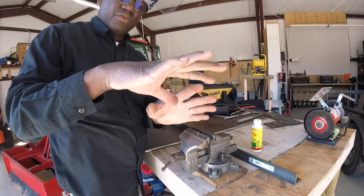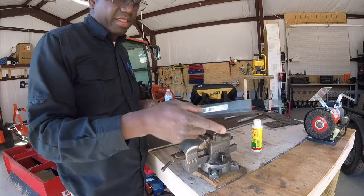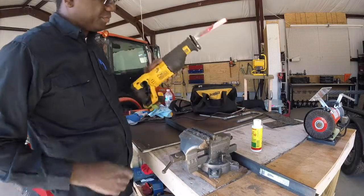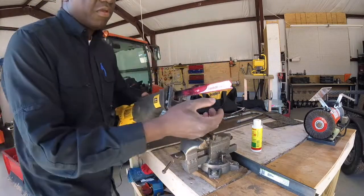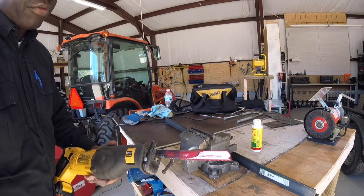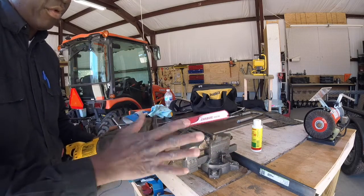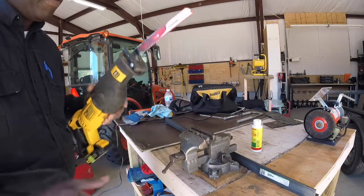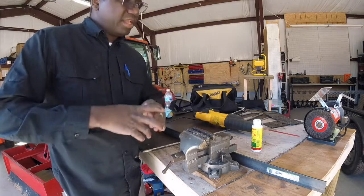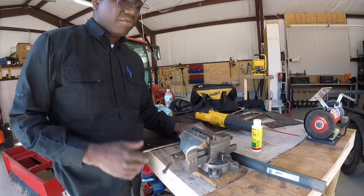What I'm going to do now is fit the plate with the studs to the wheel first, then get some measurements. Then I'm going to cut this off and weld it to the back of that 1/4-inch plate — this is 3/16 angle that I'm going to use. I bought the Diablo carbide blade for a sawzall to try it and see if it makes a nice clean cut. It should do 3/16 with no problem. If not, I've got a cutoff wheel, but the cutoff wheel has so much debris flying everywhere — this sawzall blade's millings just fall straight down.